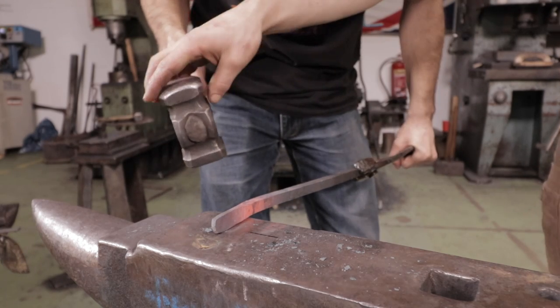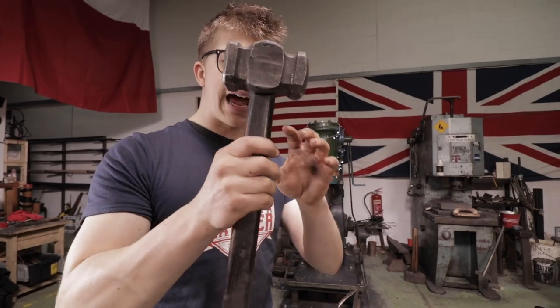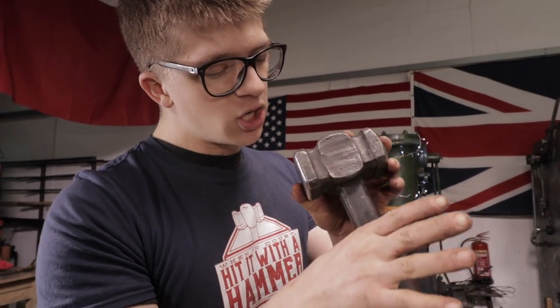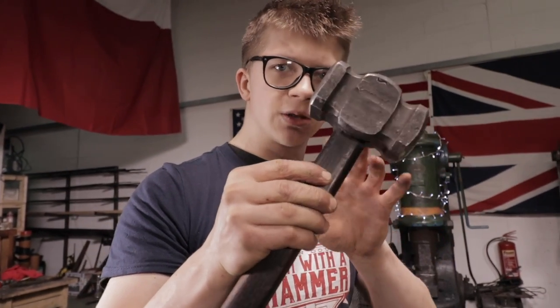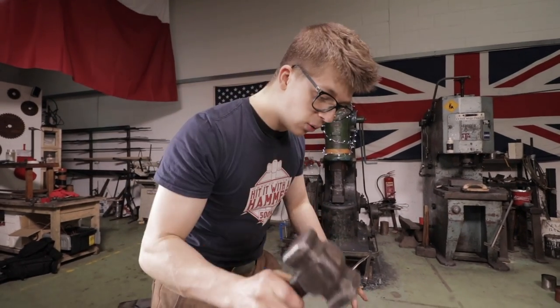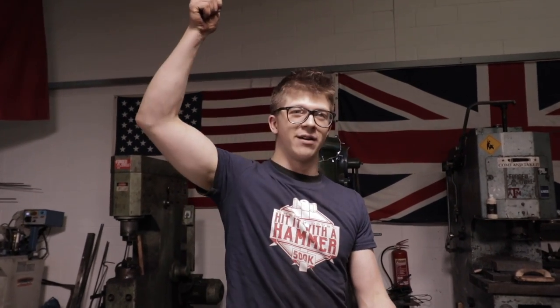Just come like this and give it a slight little peck right there to straighten it. Let me give you a little bit of a rundown about how I like to hold the hammer. I like to have the hammer held kind of a couple inches away from the head or so — sometimes lower down, sometimes close to the head. It gives me lots of good control. I'm holding the hammer slightly in my fingertips. I was noticing you were having it a little more stuck into your palm. That doesn't quite give you the control to adjust your angle to a very fine degree. In your fingertips, much like a percussionist when they swing their drumstick, they use their fingers to whip it back down — you want to be doing the same with your hammer blow. You're going to get tired, and the reason is likely because you're not having the confidence to hit hard enough to let the anvil bounce it back, because the anvil is going to give you a lot of the blow back and take away 75% of the lifting of the hammer.